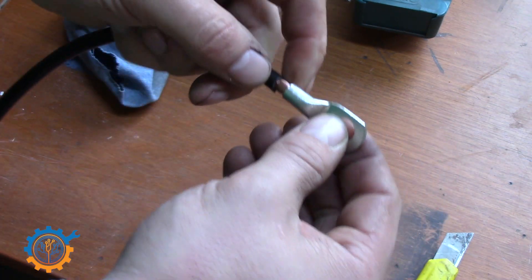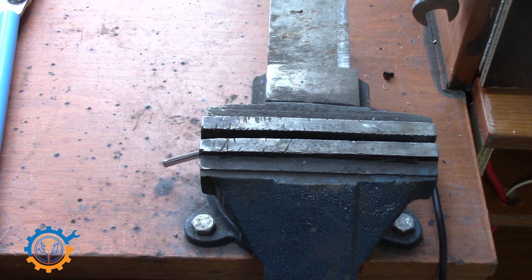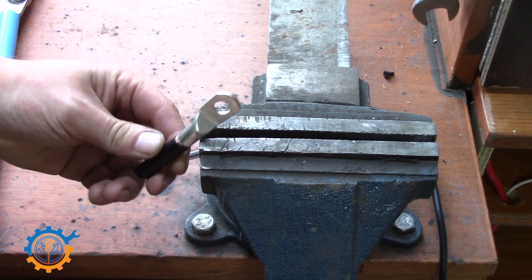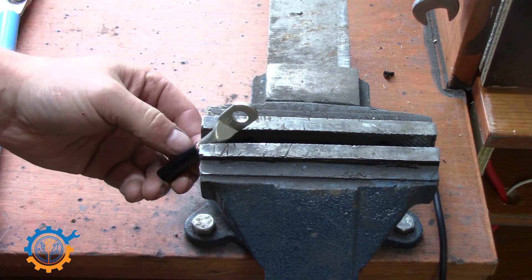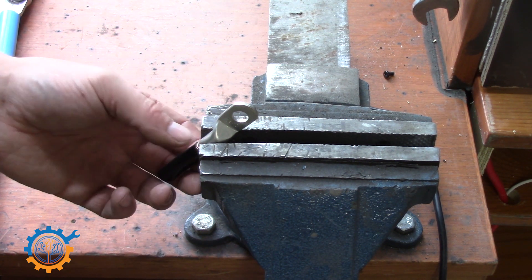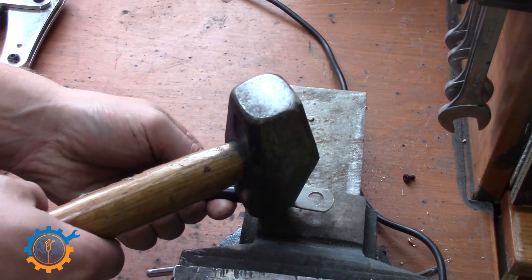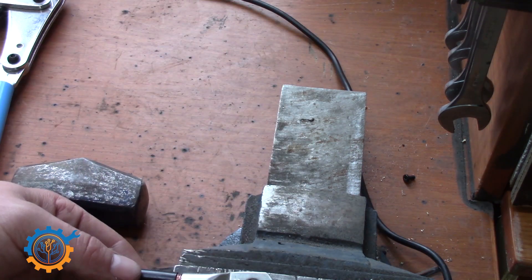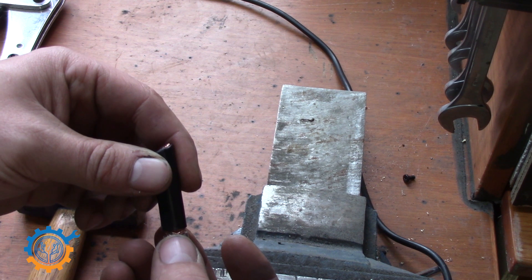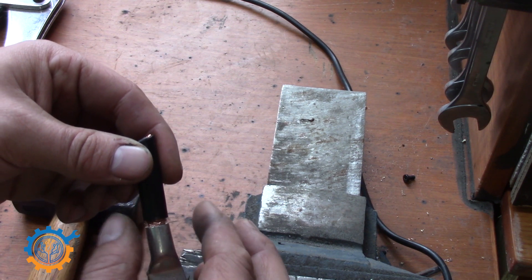So basically, if you get it long like this one you need to cut the end off and then crimp again. The first and very rudimentary way to do the crimping is actually to use the vise. Using the vise is a very simple tool to do it, but I do not recommend it if you want the perfect result — it's just a matter of putting the lug in and pressing it as much as possible. If you are going to do it this way and you don't have another tool, I do suggest that you solder it afterwards as well. You can of course also use a sledgehammer and tap it together. This will do the same thing as the vise — pressing it together. The thing is, when you press it together you are pressing it in one direction while expanding it on the other end, so even though it might be tight on one end, it may be even looser on the other.